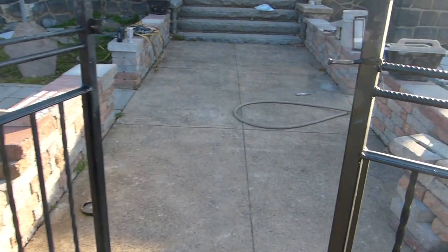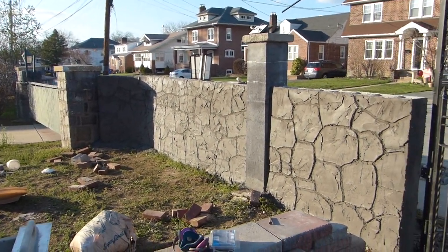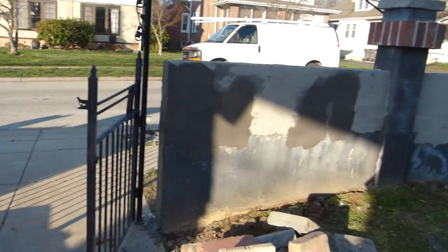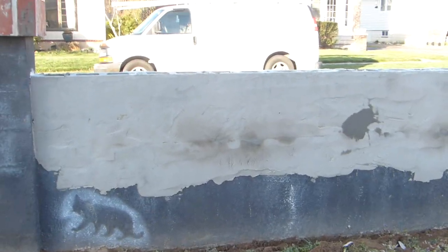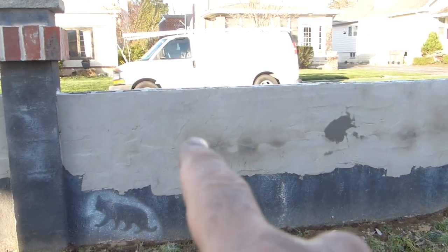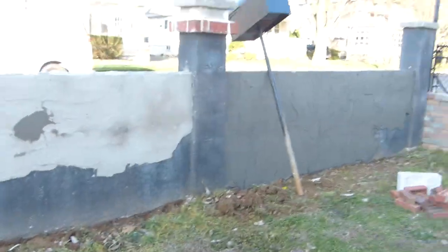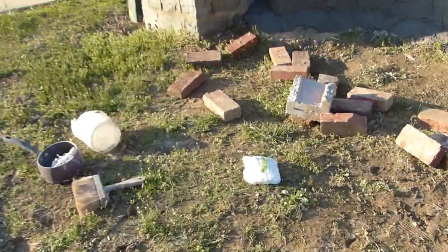Safety gear is important, but ultimately this is what it looks like before you put the joints in. You don't have to be so flat with this bottom layer — there's no value in flattening it out because your stone is going to add depth in and out anyway. The amateur can just slap this on and still be okay. Make sure you get it on thick enough. I'm making my own base basically with some repair mortar and fiberglass.